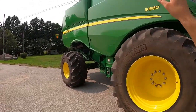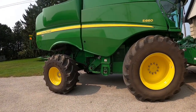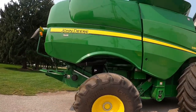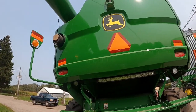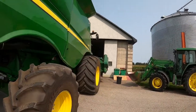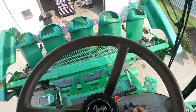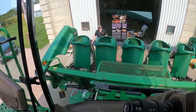Okay, the S660 combine — in the last video I posted the 7710 working ground and I told you this was going in for service. It just got back. It needed a few belts, and on the other side the auger gearbox — the one that takes your grain away — needed to be rebuilt. So it was a little expensive, but this combine is paid for, so a little bit of money here and there is not a big deal. It's a lot cheaper than going and buying a new one. Now we're going to move it back so we can clean up and grease the gearboxes in the head.